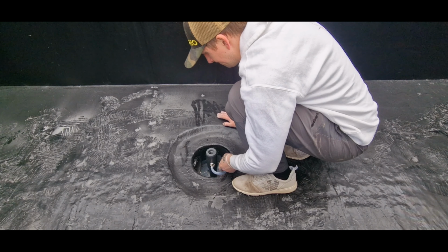It'll work fine. So the pump's going to be sitting right here, so this one is going straight to the shower, and then that one to the heater. Or no, actually, that one will go to the furthest away return. And this one will go to the nearest return. Obviously, I want the most power going to the shower, second to the other return.